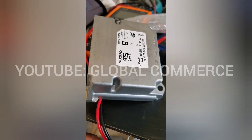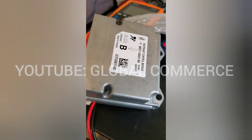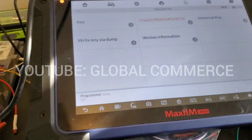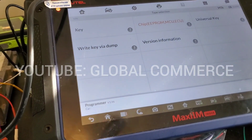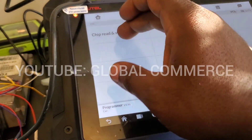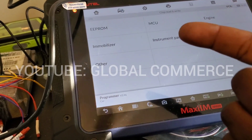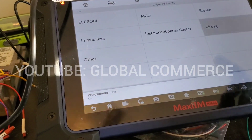Just so you know, this is the part number of the module. Four screws at the bottom release it. Alright, I've got the cleared file, so I'm back into the programming. We're gonna go to chip on this model — we can use the same built-in function. I could also go under MCU and choose the same chipset, but it's already here and it's just quicker.